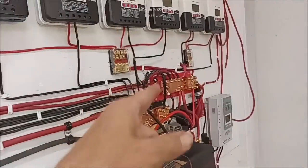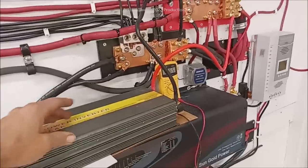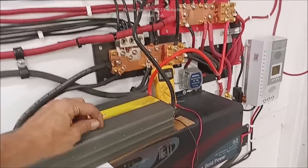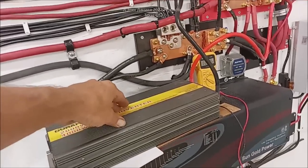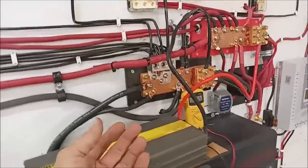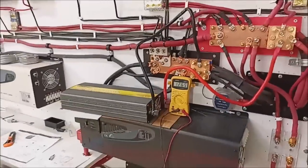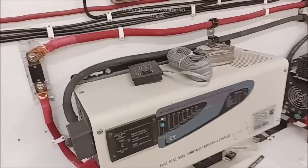You don't get the arc, you don't get that inrush of power that blows out the caps. And if it doesn't blow out the caps, do you know what it'll blow out? It'll blow out that little diode in front of each MOSFET, and you're going to hate yourself tracking it down — you'll think the MOSFET is still good. So that was an easy video; I hope you guys understood it and it made sense.